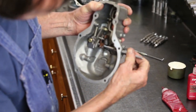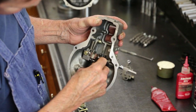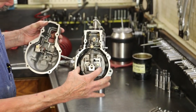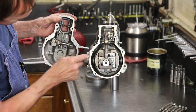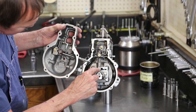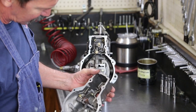You can see a little bit of the operation of this. It starts out in the back, ends up coming further forward. Idle position, full load position. Also changes my ratio of flyweight movement to rack movement. The further this sliding block is up in this track, the less relative motion it has; the further down it goes, the more relative motion it has. All qualities of the governor.